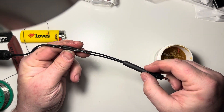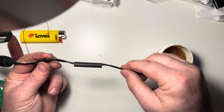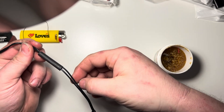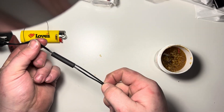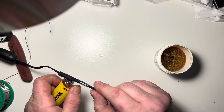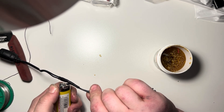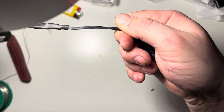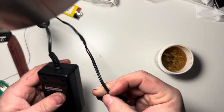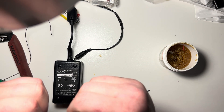You'd be fine with just these joints here, but I do like to put a section of larger heat shrink over both joints. What I usually do is cut this section long enough to cover the parts that are separated — ideally long enough to cover from here all the way to here, because I split the wires apart quite a bit. But we'll shrink the larger section down. I like jet style torch lighters better. And there we have our two connections — soldered, heat shrunk, and then heat shrunk together. That's the way we would do it in an operating room for five volt power supplies that do fiber to DVI conversion for 10, 20 years. Hope that helped!